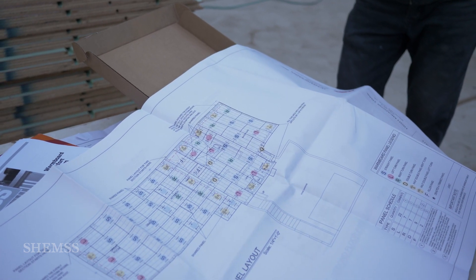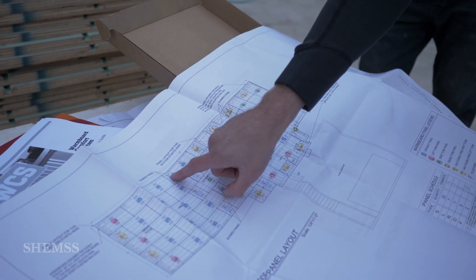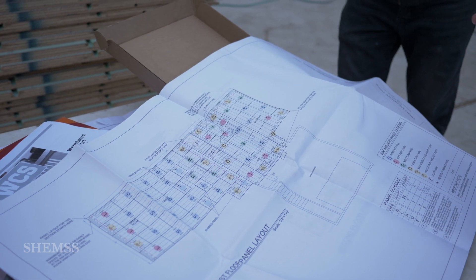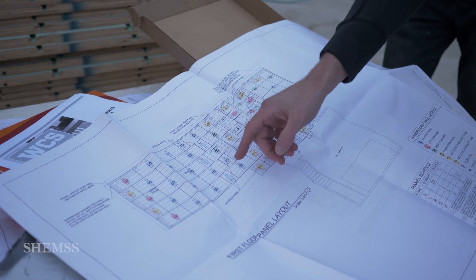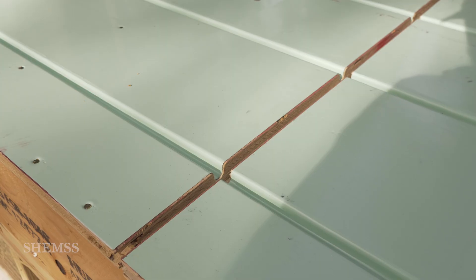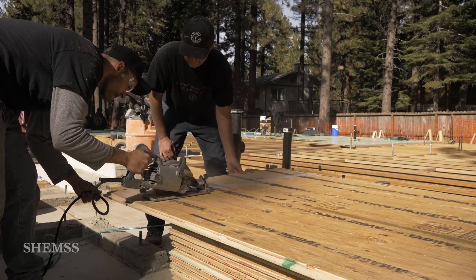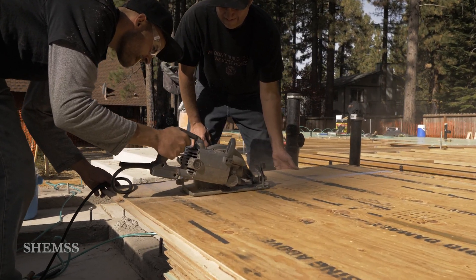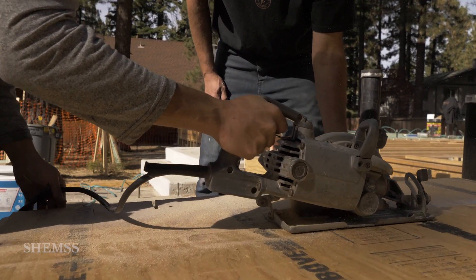Full sheets are panels without asterisks. If a panel has an asterisk, you modify it to fit the particular joist bay. You may also have shared panels used across multiple locations. When in doubt, treat it like traditional subfloor — penny nail gap on the four-foot side, aluminum side down when cutting, rip it with a normal circular saw with your depth set as you typically would, and snap your lines as usual. Pretty straightforward.